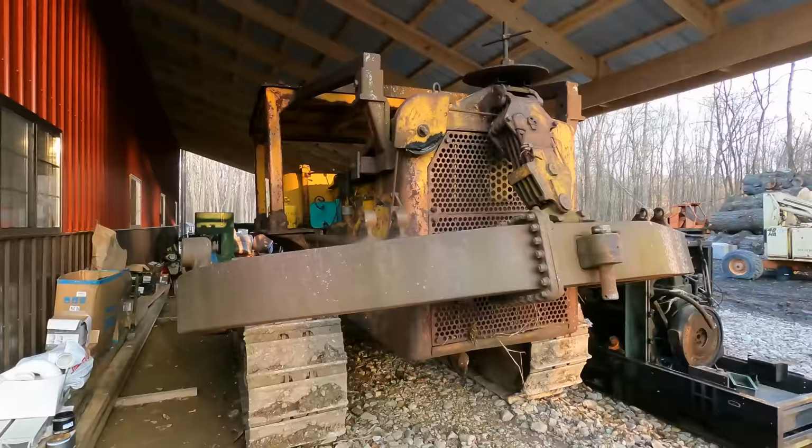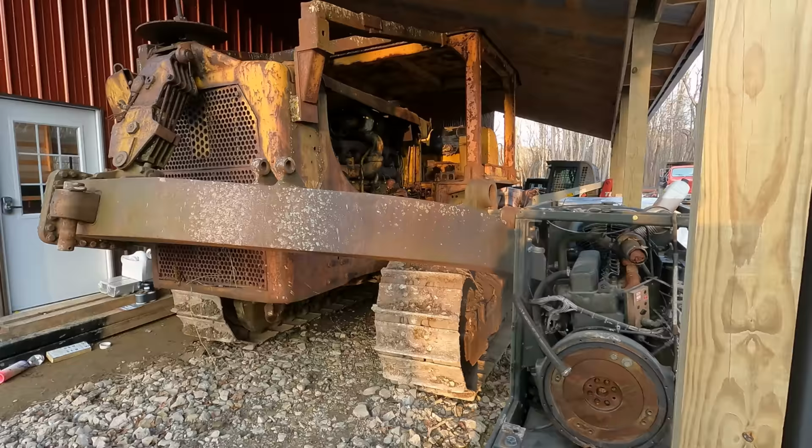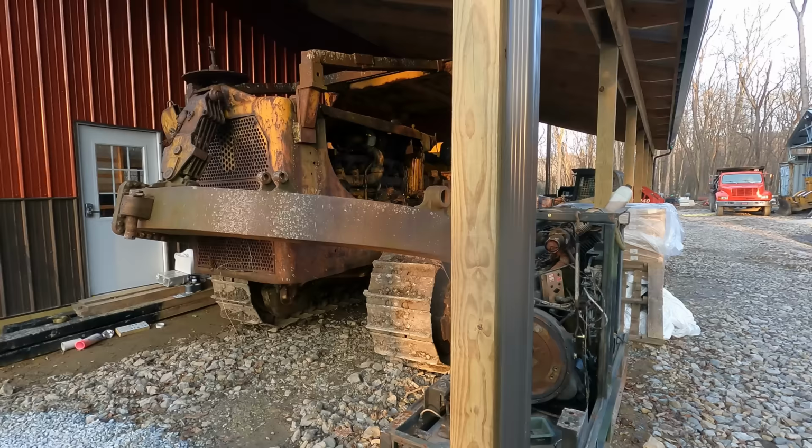One thing nice about cable blades versus hydraulics is you can leave the blade up in the air like this, and unless you have things adjusted wrong, it's not gonna ever come down unless you get up there and actually shove the lever, which should not happen. I'm gonna leave it in the up position in case I need to move this machine around. Since I can't start it, I'm gonna have to tow it. And yeah, that'd be hard to do with the C-frame down on the ground.